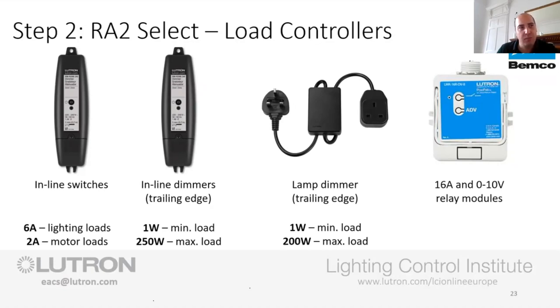I actually had one guy doing this for an infrared heater outside a bar. So he had it tied in so that they could actually put an occupancy sensor up at the smoking area and kick the infrared heater in and out. And you could put that on a time clock. There's various different things that you can do from there.